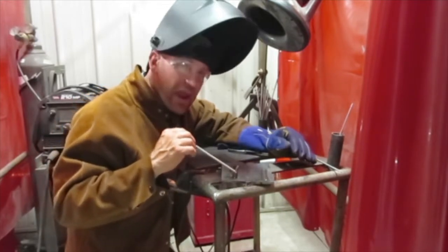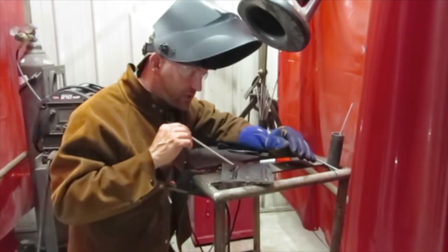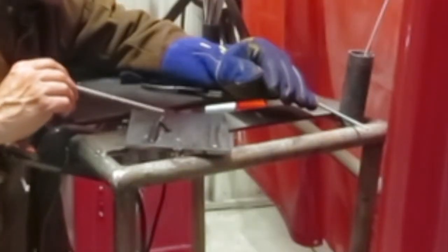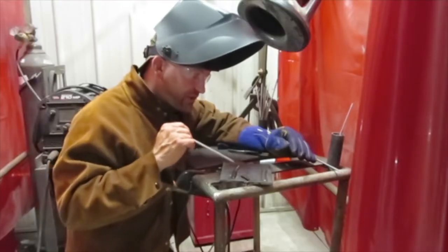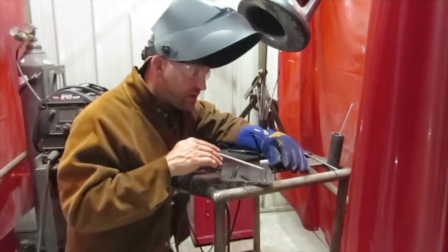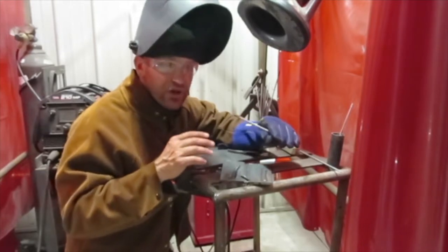We have to chip that off. When you have a really tight pattern and your weld is really solid and your motion is slow enough, the slag comes off easily — that's the slag that gets chipped off. Now, this is a 6013 rod and that slag comes off really easy. This one was a 7018 rod and it sticks a little bit harder, so you have to chip it off.